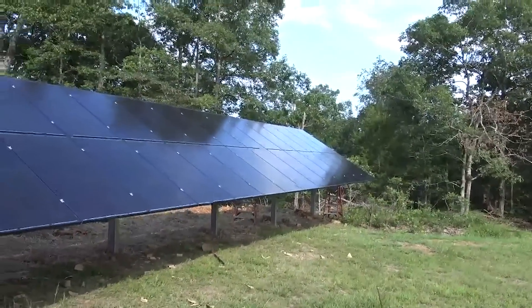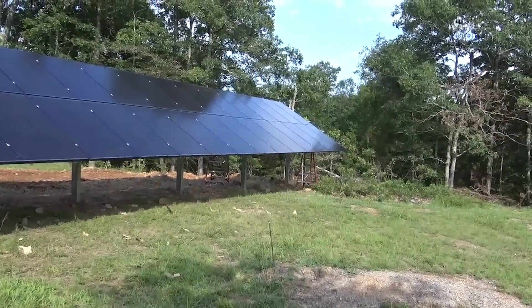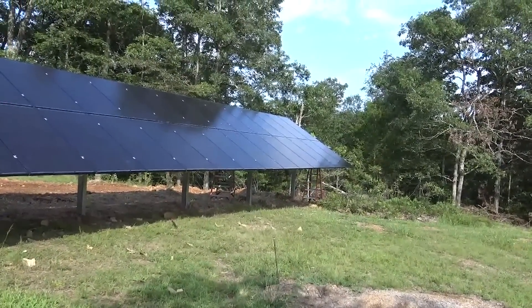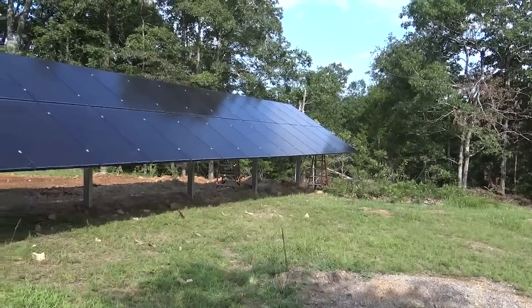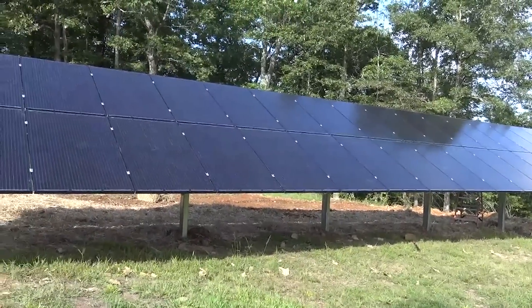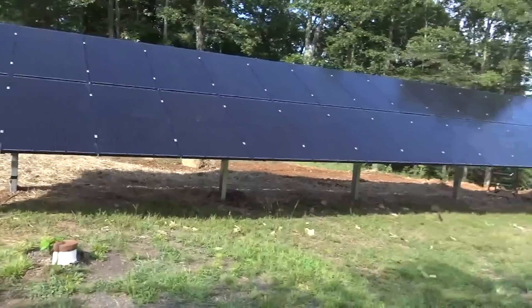That's it — this is in a great location with a really good solar window and she's not going anywhere. The base design rating is 110 miles per hour wind. There's not a significant snow load in this location though they do get snow — they have a standard design for zero, 30, and 50 pound snow loads, and custom engineering is available as well. The Powerpeak is really taking shape.